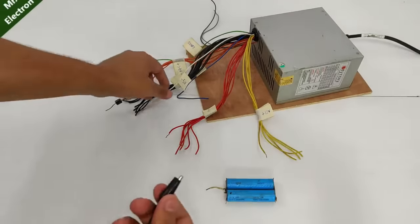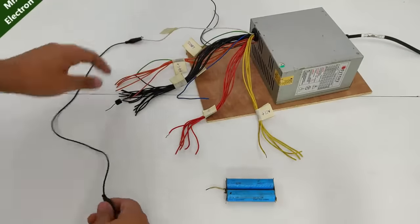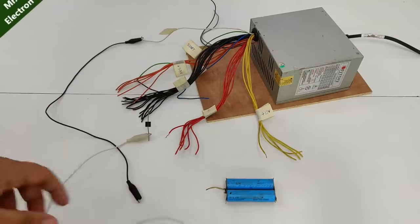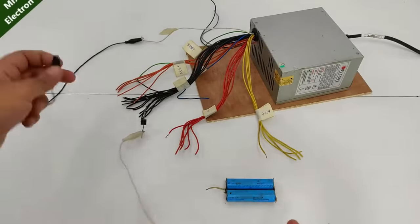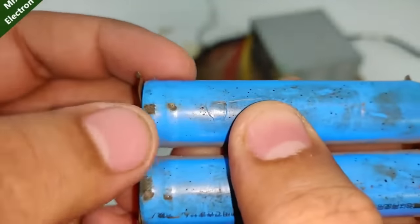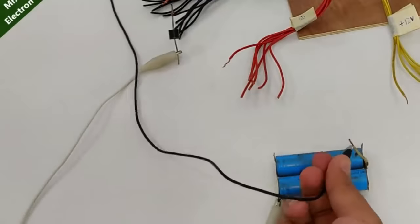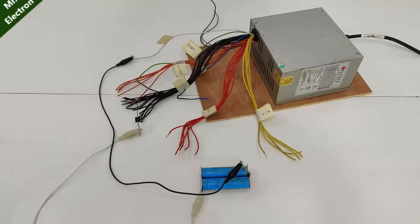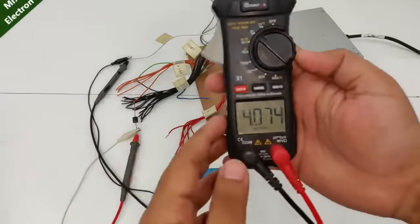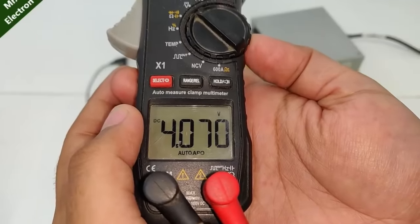Black will represent negative, of course, so negative 5 to jumper cables, link for which is in the description. And the white is for negative of the diode. So we have white one overall positive and black overall negative, and the battery this side is positive. You see there is a little indication of the positive. Yeah, so our cells should have started charging. Let's check it. So here I've connected the meter pinouts and it's showing an increasing voltage. It has reached 4 volts and increasing.